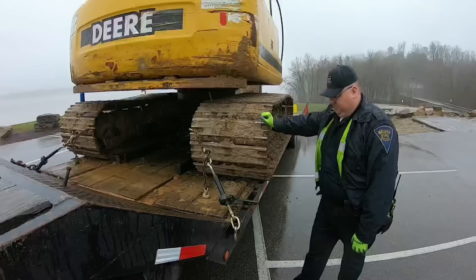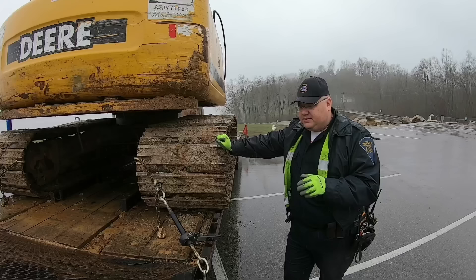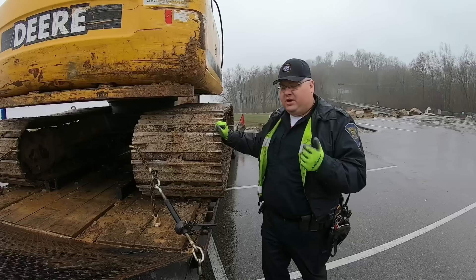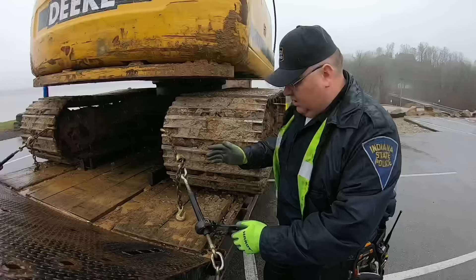When it comes to loading heavy equipment, first thing — if anybody wants to fact-check, the federal regulation is 393.130. That covers most of what we need to know. 393.130 covers the loading of heavy equipment, and this is equipment greater than 10,001 pounds. When you've got any piece of equipment greater than 10,001 pounds with tracks, wheels, anything like that, first thing you've got to have is four independent corners.